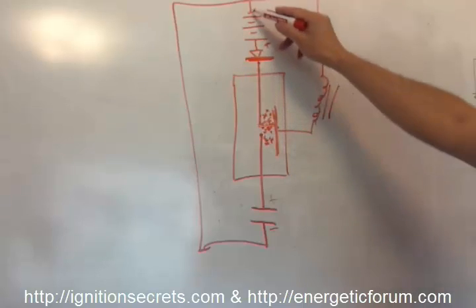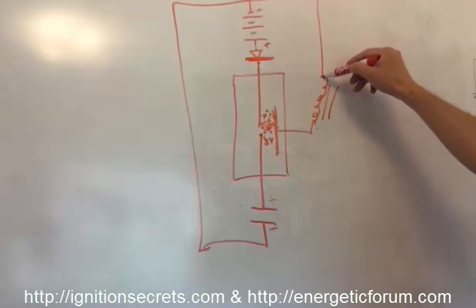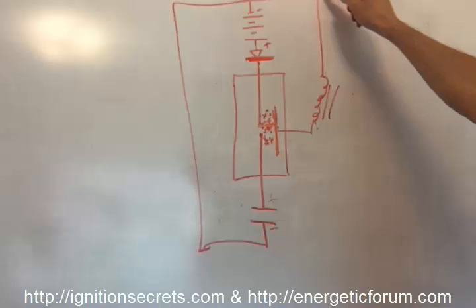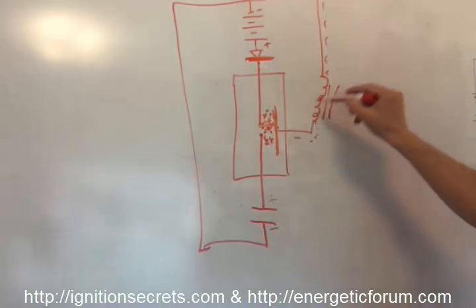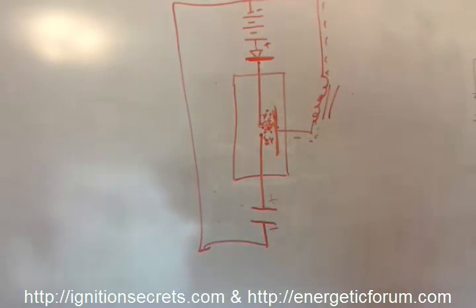This is possible because the gap was ionized by the high voltage cap discharge. So the battery goes through this diode and through the inductor right after the high voltage discharge, with the battery current going in the opposite direction — giving an enormous, very quick discharge through the inductor to charge it really fast, producing a real strong pop.